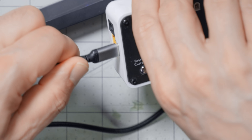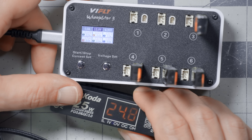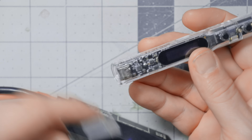Unfortunately, it does not remember the cutoff voltage between power cycles, so if I turn it down to 18 volts because I'm using lithium ion, then unplug and plug it back in again, it forgets. The Speedy-B remembers — Speedy-B would be perfect if it actually worked. The AO Coda is currently my go-to when I know I'm going to be somewhere where I need to charge my phone. On the whoop charger test, it outputs 12 volts and gets up to 0.8 amps — a little better than the Speedy-B.